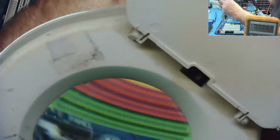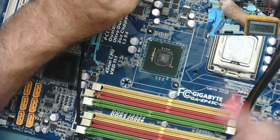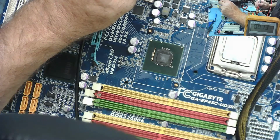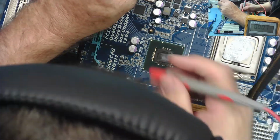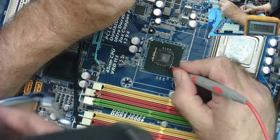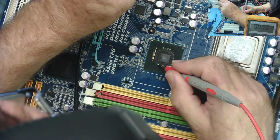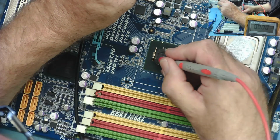Again, the easiest place to look is on the capacitors, yeah. And I'm going to use the magnifier, so I know you can't see exactly where I am, but that's what I need to do, yeah. I can see how they are. So these look like the capacitors. I've got a 5 volt standby, haven't I? Yeah. I'm expecting that to turn up somewhere down here.